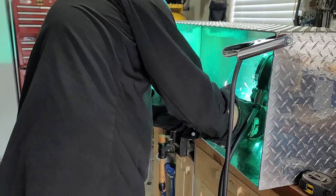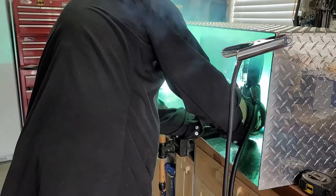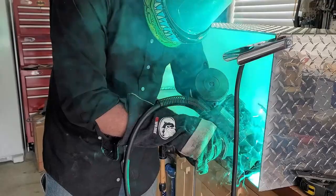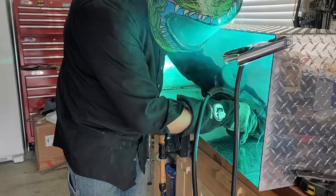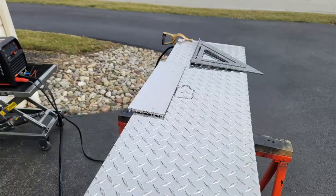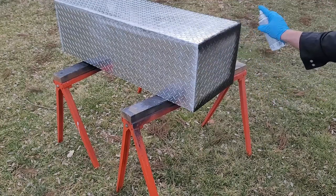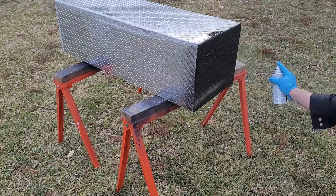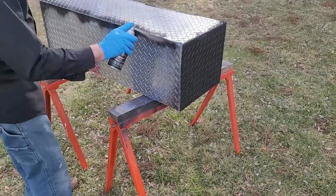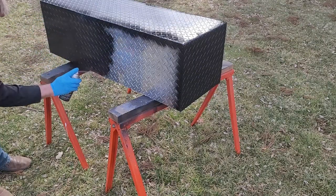With the lid drying, I went back to the main box to weld all the inside seams. After welding the inside, I marked out where the latch is going. I used the plasma cutter from my YesWelder CT-2050 to cut out the latch opening. Unfortunately I took a picture instead of recording it, so here's the picture — but the plasma cutter worked out perfect. After cutting out the latch, I prepped the main box for paint and painted it the same satin black, doing three coats as well — the first coat as primer and then two more coats.